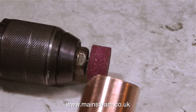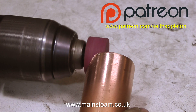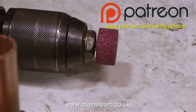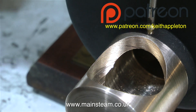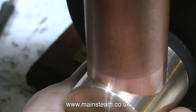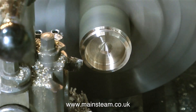While I'm grinding this copper tube — which is not exactly rocket science — I'd like to take this opportunity to thank all of my Patreon subscribers for their support. The chimney is quite a good fit in the flue tube to start with, and all the 6BA bolt does is stop it working loose.